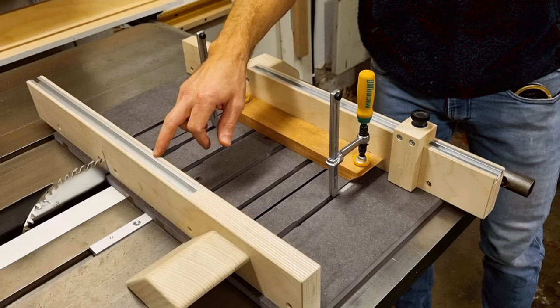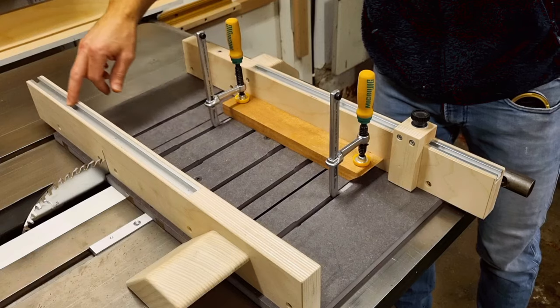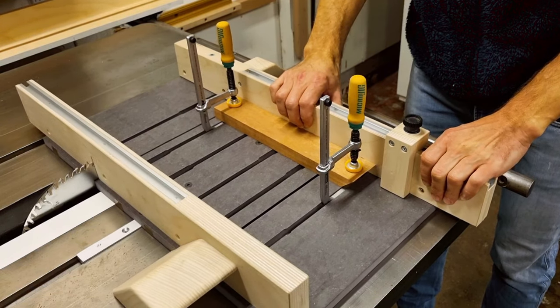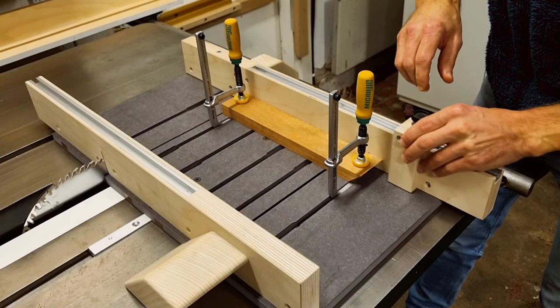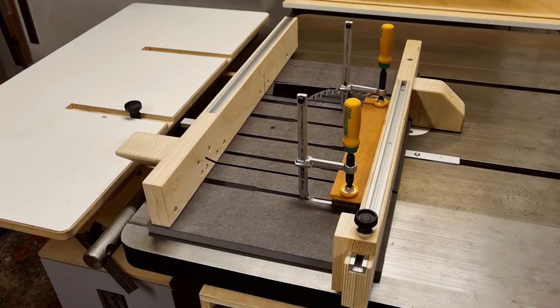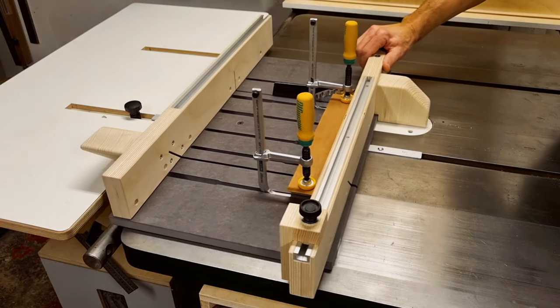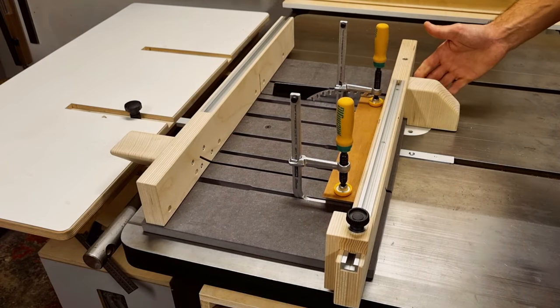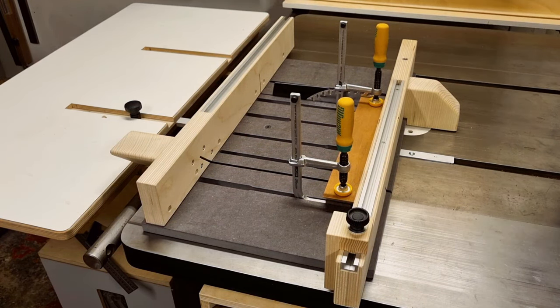The fences are made out of 2 by 15-millimeter Baltic birch glued together. On the top side I have a routed-in T-track on the side of the fence that I'm using, and there I have a very simple but very stable stop that I can set to any position. Just as on my full-size sled, I stop the travel in the off-cut table. I think this is the safest way to prevent the sled from traveling too far, so I added a threaded knob here and the miter bar stops against it. On the back side of both fences I have these blade covers, so the blade will never be exposed on the back side of the sled.